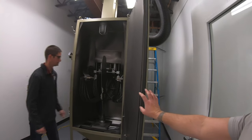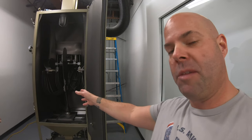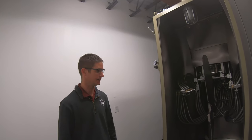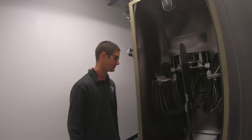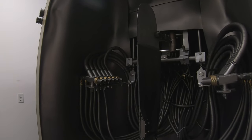Let's talk a little bit about the shot peening cabinet before we get going. You don't run to Walmart and go past the gun section to the shot peening section to pick these up. This is a custom cabinet built specifically for airfoil shot peening — that's the only thing it does — but it's a pretty remarkable machine. It's got 14 nozzles, and the whole thing together moves 460 CFM, which is a lot of air.